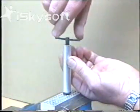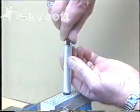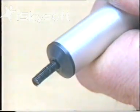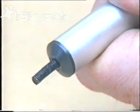Now don't try this, even at home. Some users of threaded mandrel inserting tools have tried to use them as TBOs. The threads are engaged, the mandrel cannot move forwards. A gentle tap on the end of the mandrel is used, attempting to break the tang. The gentle tap becomes heavier and heavier. The mandrel bends first, giving a good indication of how strong the helicoil really is.